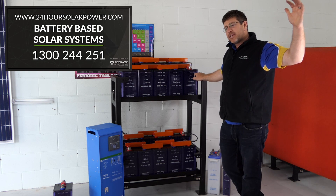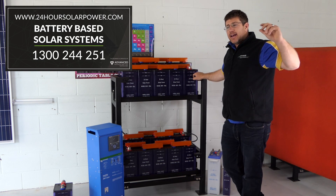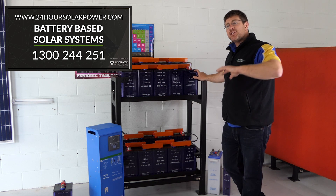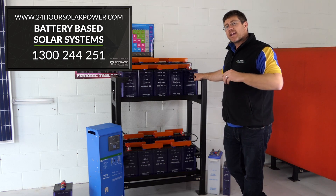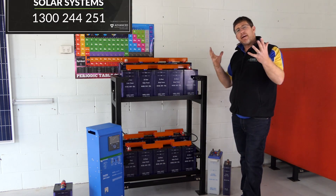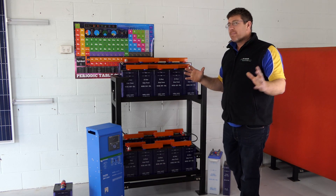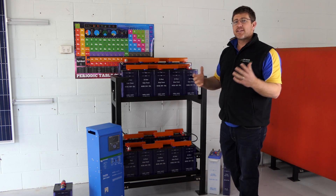Because what happens — the more solar panels you get, there's a balance where you've got more usable energy during the day. So if you want to put the smaller batteries in, that means you can just do more stuff during the day, but you're not going to have that battery storage to store that excess energy. So it's a balance and it really comes down to how you use your energy and understanding it. That's why batteries are not simple — it's not one size fits all, because everyone does things differently.